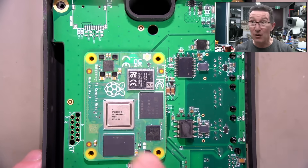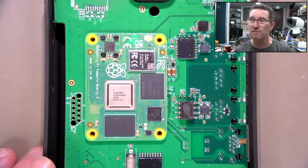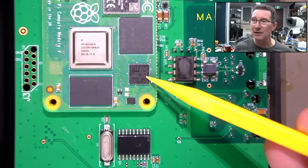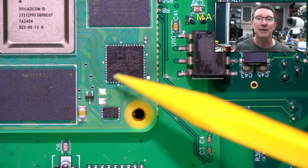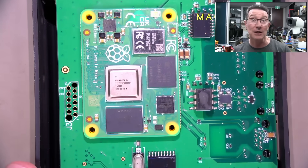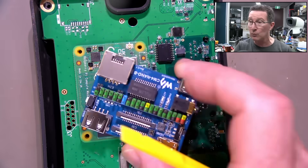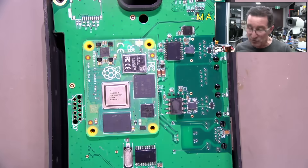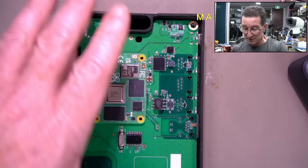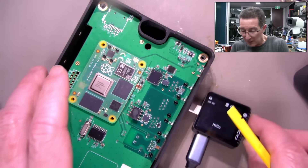Just another follow-up video on this failed Raspberry Pi Compute Module 4. The Ethernet chip - this Broadcom down here - looks like it's failed and it's getting red hot. I've got it on the AERL gateway that it came out of, that it failed.